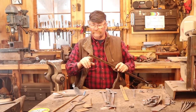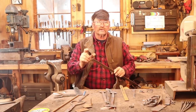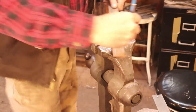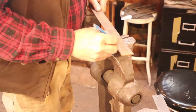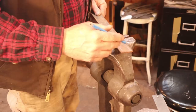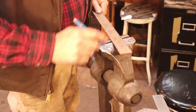Make the hasp suit your project; you don't need to duplicate what I'm doing. This is sort of a proprietary design that goes with the Dutch tool chests, so chances are your hasp will need different design features. The first thing I want to do with the wide bar is trim it down a little bit — I want a one inch tail, a few inches long, maybe three inches. That'll get forged just like the end of the hinges did, and the wider section is where the joint will be. I draw lines by eye using my finger as a little fence with a silver pencil, about an inch apart. You can forge this instead of cutting it, but in inch and a half material that's only eighth inch thick it wants to fold over and it's a lot of work. I'm going to cut it on a bandsaw — you could chisel cut it, hacksaw it, or grind it. Since this is a production item that will change shape entirely before I'm done, I don't mind bandsawing it because none of that will show.